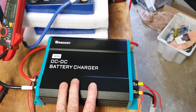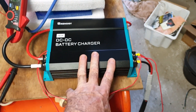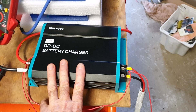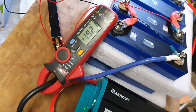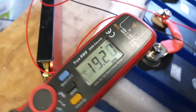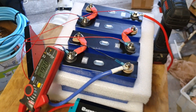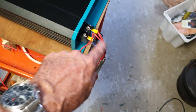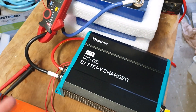I'm going to run separate solar, separate DC vehicle charger, and separate mains charger because I like having the resilience — if one fails I can still maintain the battery somehow, rather than having everything in one unit. I was just looking for a straight charger. These previously did not have a lithium profile; they do now. It's now running at 50 percent, so I'm getting 19.2 amps into the lithium battery. It's been on for well over half an hour. This is a 100 amp battery — four 100 amp cells to make up 12 volts. I'm using a 10 mil cable running into an Anderson plug connection, and 10 mil running to the battery.